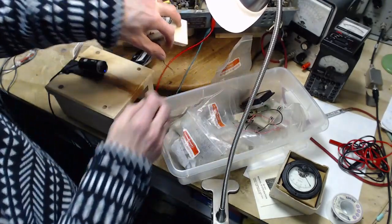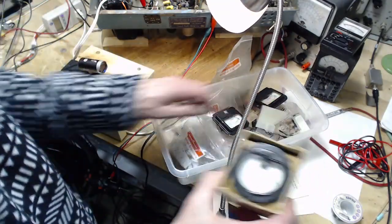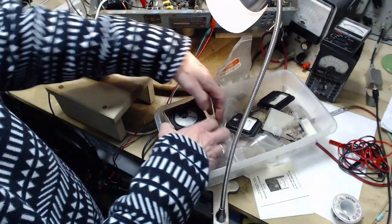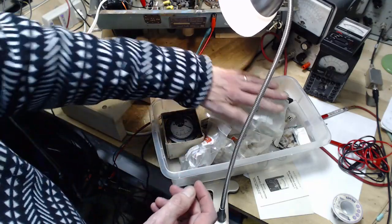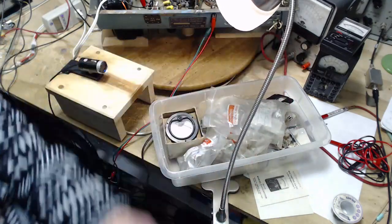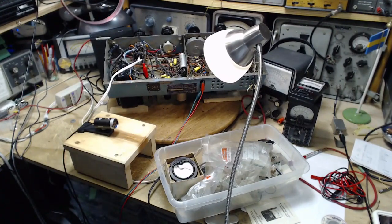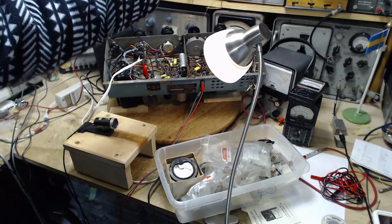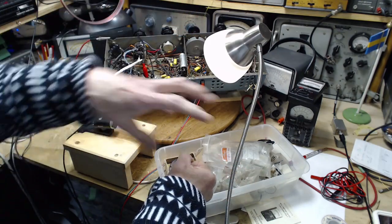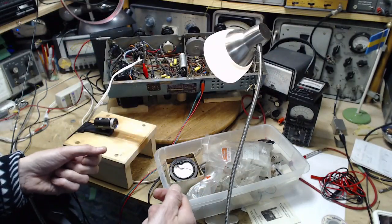Now, what would a meter look like if the meter was designed to measure 20,000 volts or 30,000 volts? In the power company I worked for, high voltage meters that they used to read high voltages, 13,000 volts, 8,000 volts, things like that. The meter, you held two separate rods. One was just a rod with the contact at the far end, and the other one has the meter movement sitting right here. And then there's a long rod, so 3-4 feet long.